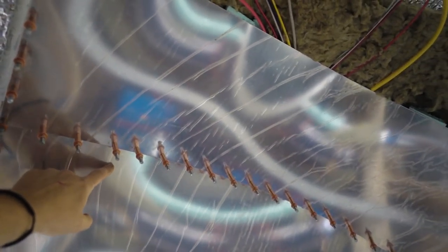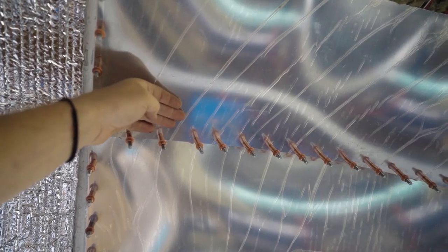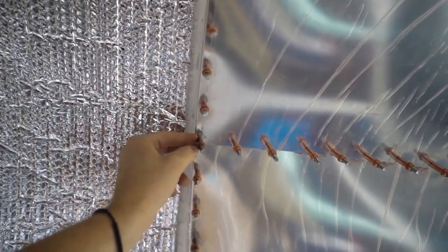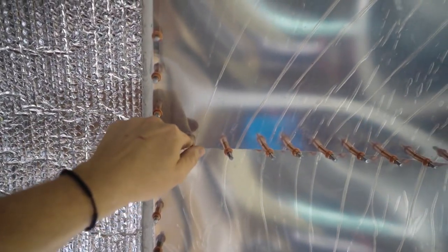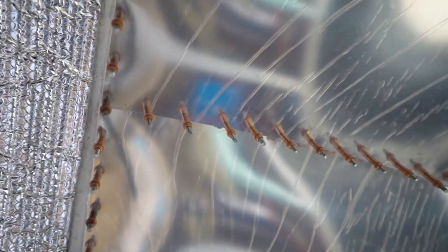I'm gonna peel this plastic down right here just below the screw holes. If not, try to land this edge on the plastic. And as I go with my rivet, I'm gonna take two or three out ahead, pull the plastic out from underneath, put it back in. I'm gonna leave this plastic on. So work this down, put the rivets back in, come back a couple holes, peel this plastic up, pop rivet it. So just kind of walk it all the way down so you're protecting the metal as much as possible during this, because trust me, any little ding or scratch will nick it up. So that's just the life of aluminum.